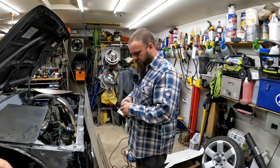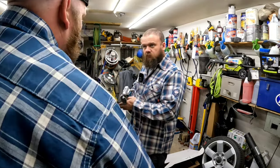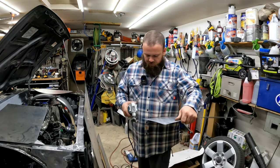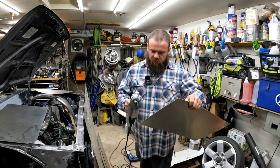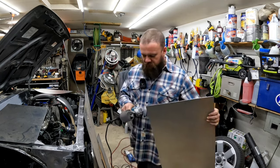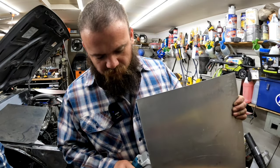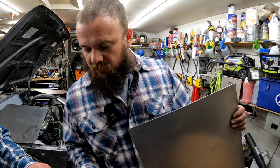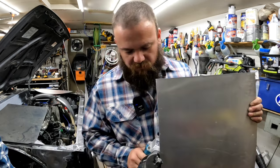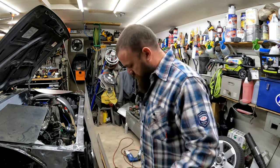So I was wondering, what's this spoon for on the backside? Is that supposed to protect your fingers on the metal? Oh, I thought maybe it's supposed to rest on the metal. Because if you're pushing it and that steel's curling, if that wasn't there, you would just ruin your fingers. You see this? That's a bad boy. Oh, so you can check your gauge. So if it won't fit in that, then it's too thick. See the numbers right there? 18 gauge or 16 gauge, so this is 18. Cool. It's kind of cool that they built that in there.